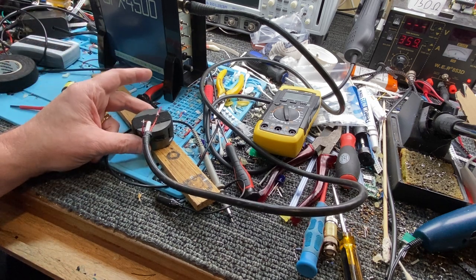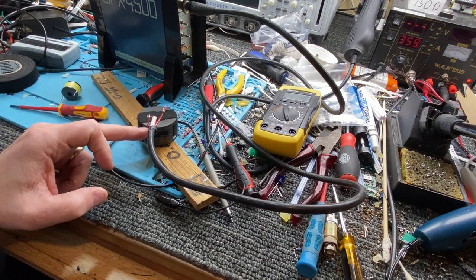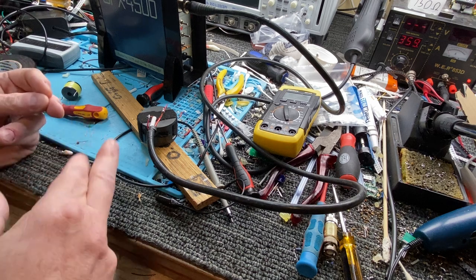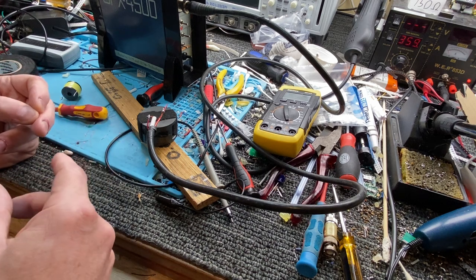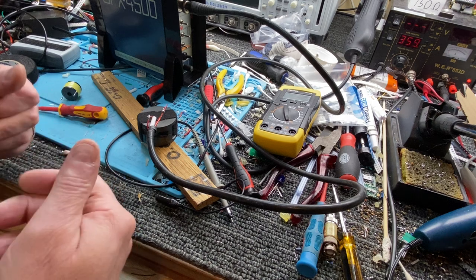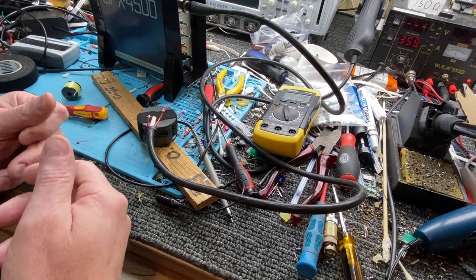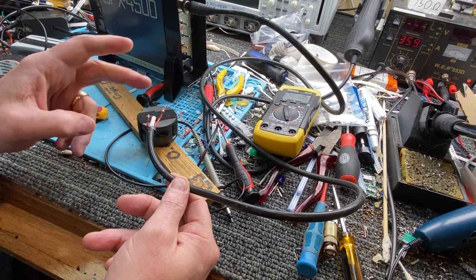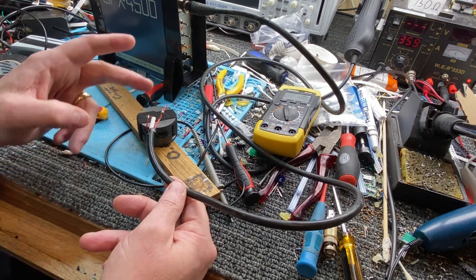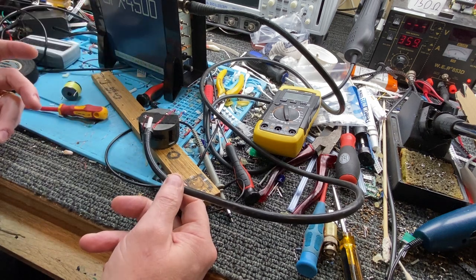If you get a rod and wind it with the same wire as this wire here, because it's an open-ended structure with no closed magnetics, you're going to have to put a lot more wire on the thing — maybe 150 turns, 50 turns, it just depends. Measure the inductance. When you get up to about 300 microhenries, you can put the winding in a bit of PVC tube, paint the inside with carbon and put the braid with conductive epoxy onto it, and you've made yourself a really good little high-powered pinpointer.